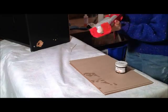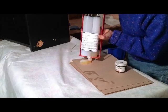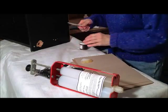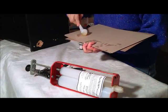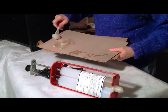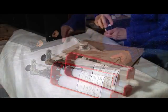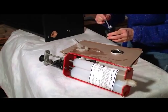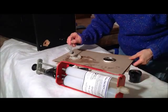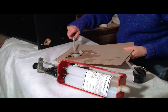Next, you may dispense and mix the epoxy. For applications where the cabinet will not be painted, you may tint the epoxy to match the color of the shelves you are repairing. Art has available dry powder pigment, which you may sprinkle over the epoxy and mix until you have reached the desired color.